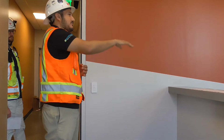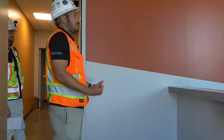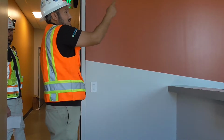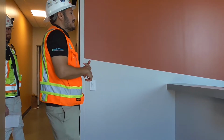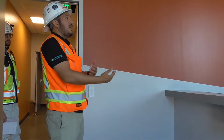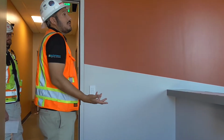But let's say right now in this room, you have all this natural light. I want these lights off. I'm going to hit it off. Well, all the control receptacles, they're still going to stay on because they're listening to the sensor. As long as those sensors still see and hear you, they're going to stay hot. Only when you vacate the room for 20 minutes and those sensors have timed out will they actually turn off.